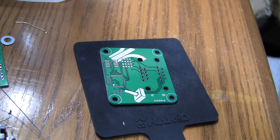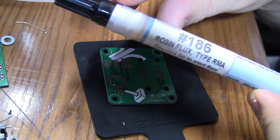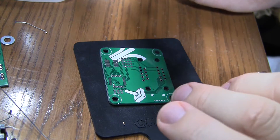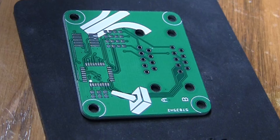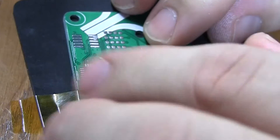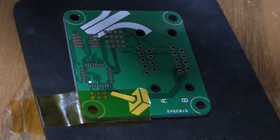You can tell I'm not a pro with this. Now I'm getting the chips and other pieces ready. Here's the flux that I'm using — it comes in a pen so it's nice and easy to put on. I just make sure I get the pads all nice and wet with the flux. Without the flux nothing here really works. I'm going to protect the pads for some of the discrete components because I don't want to get any solder or flux on those.